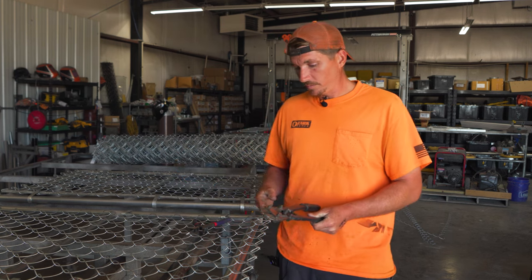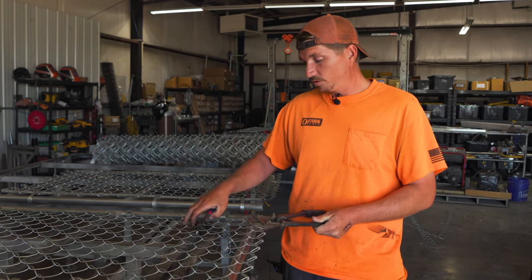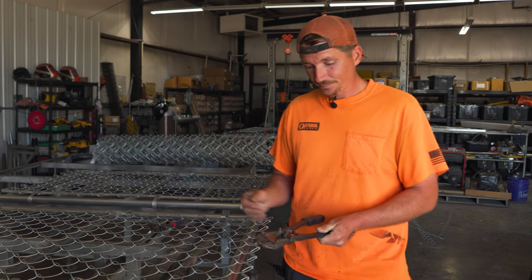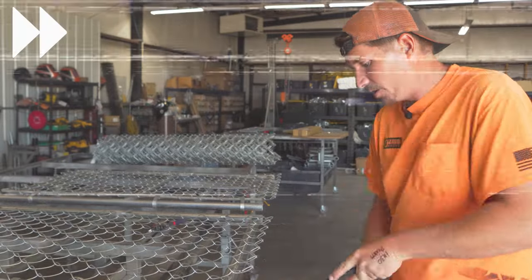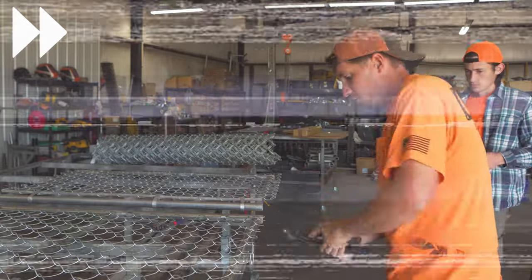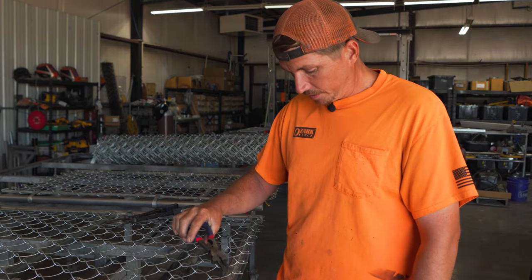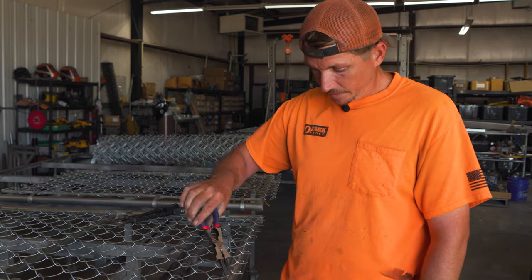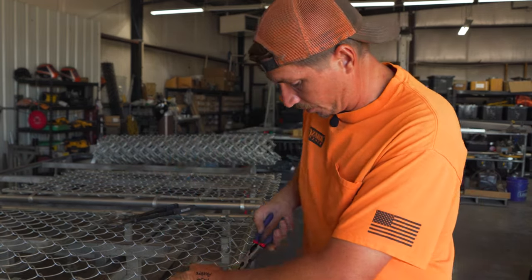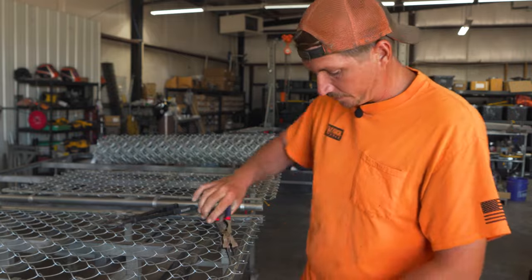To demonstrate this we're going to be using bolt cutters to cut both. I'll start with this one and then use this pair of pliers to knuckle over the fabric. You wouldn't ever want to leave a gate like this — that would not be great. The idea is to shorten the chain link and make it look somewhat like it was meant to be this size.